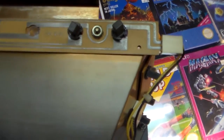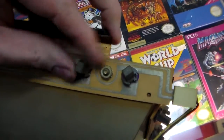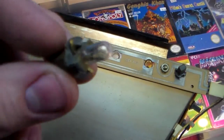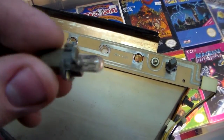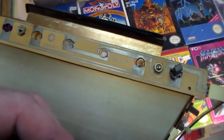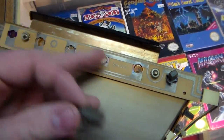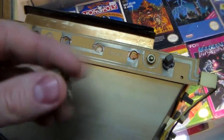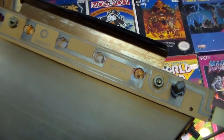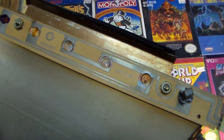They have these little connectors — little twist things — and a bunch of them are missing; they fell out over the years. If you remove one, they're kind of brittle because they're old. If you haven't seen one of these before, it's the same thing that's on an instrument cluster in a lot of cars — I mean like 80 percent of cars. The bulb you need is marked number 73, which is a dash indicator light on a car.